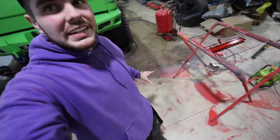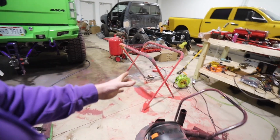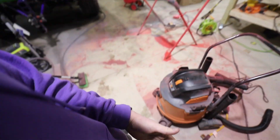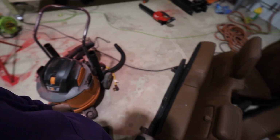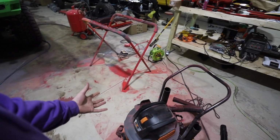So what I have to say is, without the pressure regulator, it makes a very large mess. Because you're spraying like 30 PSI, not 5, and it's like a light dusting and all the powder attracts. I'm wasting a lot of powder. It's everywhere. Obviously, powder is fine. It blows off and it cleans up easy. But I'm making a mess. I'm wasting a lot of powder.